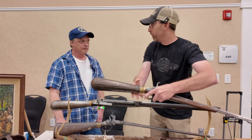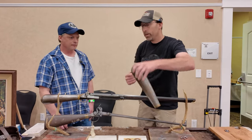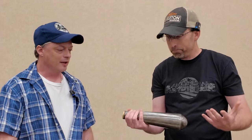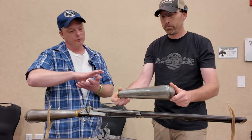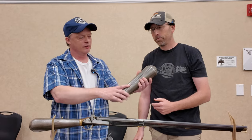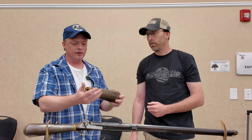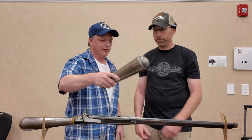These butt reservoirs have to hold 850 PSI while remaining airtight. They started with a flat piece of steel that was wrapped around, with a cup made on the back. Rivets run along the seam to hold it together, and then the entire thing is submerged in brazing material. The brazing is what actually seals the tank — not the steel itself.